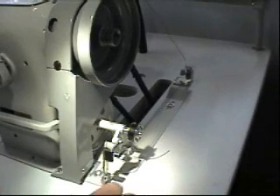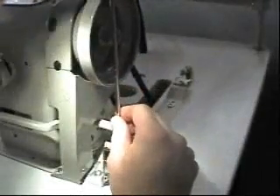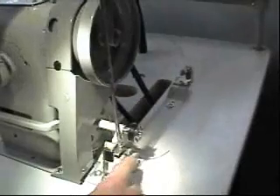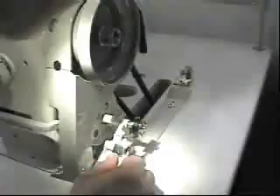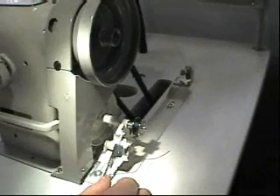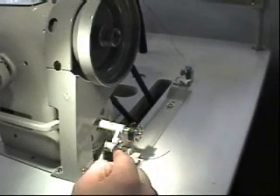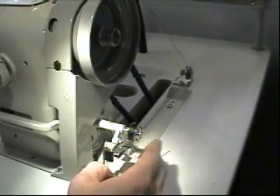You'll see that we kicked off a little bit soon on here. If I want to put a little bit more thread onto my bobbin, I'm going to tighten this screw down, and what that's going to do is move this finger down a little bit — that's going to allow more thread to come on before it pops off. If I want less thread on, I loosen that screw and that pops it off sooner.